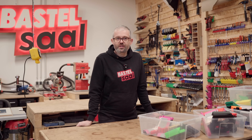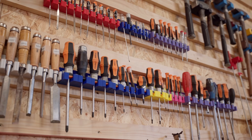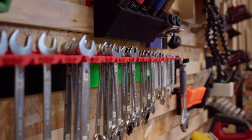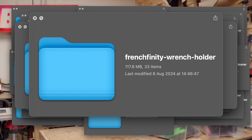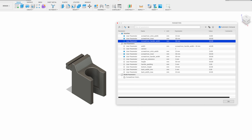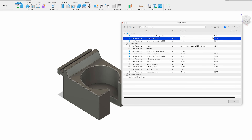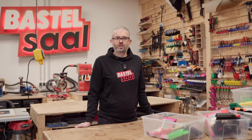In the last month I designed about 30 different holders that perfectly fit all my tools while fulfilling the French cleat requirement of easy front-axis removal. There are some very generic holders like allen key, bit, screwdriver, pliers, wrench, and can holders. In general, holders are named after the first tool they were made for, but they can often be used to store similar tools as well. Every holder I constructed can be modified to match any other tool with the same shape — it will take less than a minute to configure a holder, like a screwdriver, once you're familiar with Fusion 360 and the Frenchfinity concept.